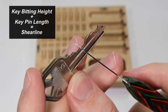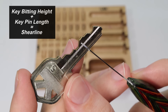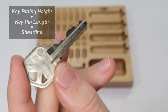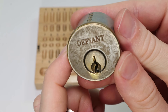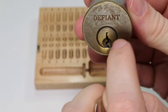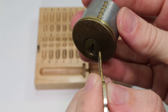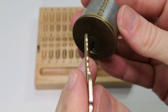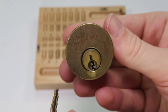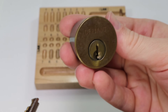So you're going to have a long key pin here, a shorter key pin here, but going across it's all going to end up at the same height. Why that is useful is when you have a lock in its resting state, there are going to be the key pins in this area right here which is called the plug. But inside of the plug from the top there are going to be also pins called driver pins which are going to sit down recessed, and it's going to prevent this from turning over because they're going to physically obstruct the lock.